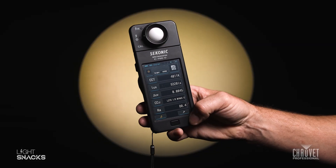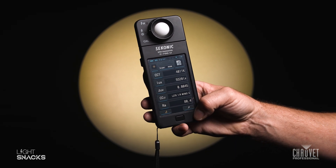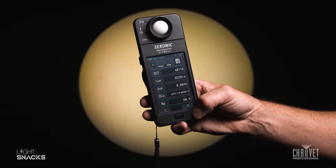Using the yellow and magenta filters gives us a much more precise way to get to a specific color temperature, staying close to the black body curve, and maintaining a good CRI. We hope you've picked up some cool new tips and tricks on how to get the most out of your CMY system and your moving heads. Until next time, I'm Mike Graham and thanks for watching.